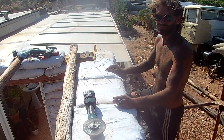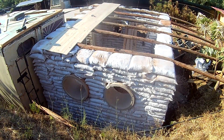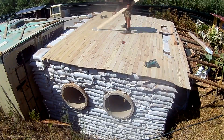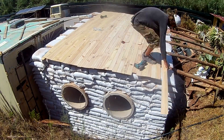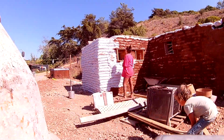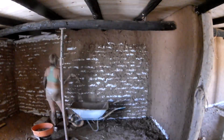We've learned a few things since then to hopefully improve this roof. Basically, we're going to apply tongue and groove wood on top of these beams — that's the visible surface from the inside on the ceiling, as we did in the house. On top of that we'll place some waterproof membrane to prevent condensation, then some insulation — standard blue foam boards, polystyrene or something like that. Then several layers of waterproofing and our green roof, which we're going to plant with succulents.